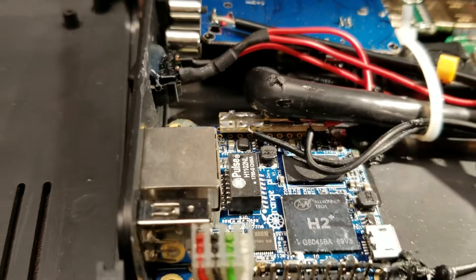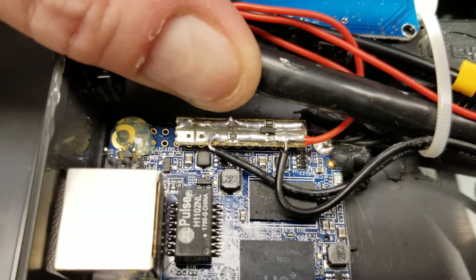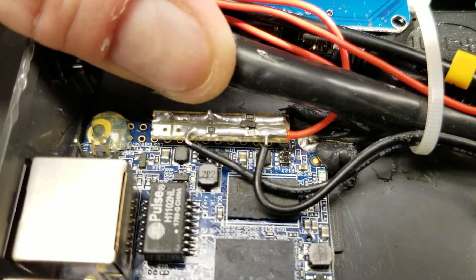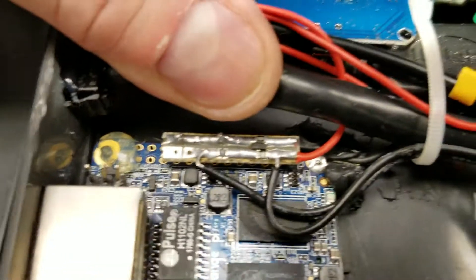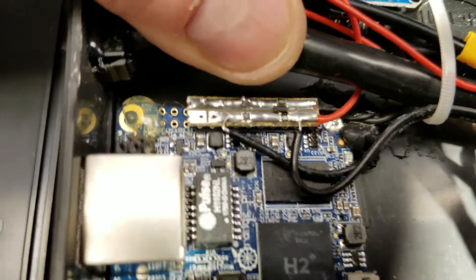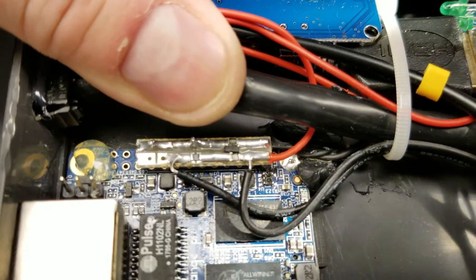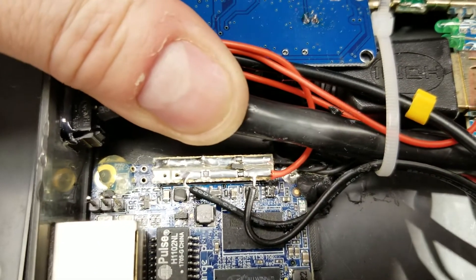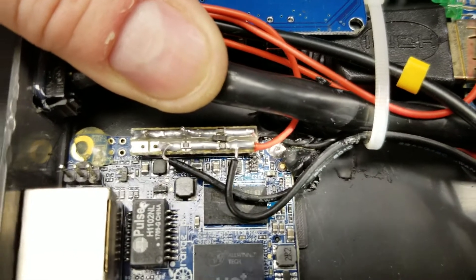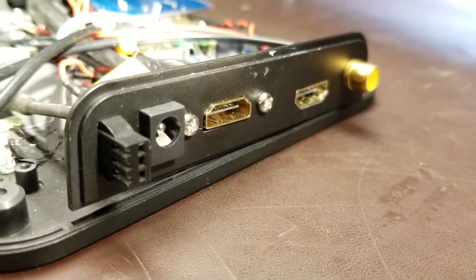Since I'm on to the Orange Pi Zero, I'll quickly show you the solder work they used to send the digital signal out to the HDMI port. Inside, they've taken a copper-clad laminate hobby do-it-yourself circuit card and attempted to make their own circuit by creating purposeful solder bridges and stacking components along two rails. You're seeing resistors on the GPIO output pins of the Orange Pi Zero with a transistor and resistors used to drop the data signal for RGB strips to 0.7 times VCC. That solder work has already caused this unit to fail — this transistor is no longer sending out a signal. For about the first day it worked, then it failed, and I used a logic analyzer to confirm.